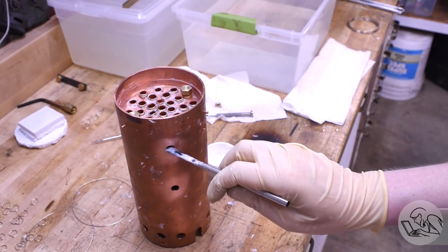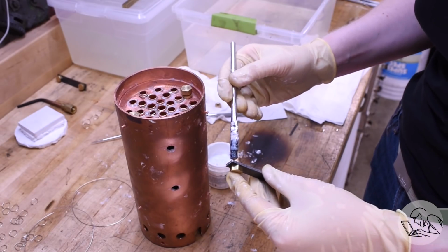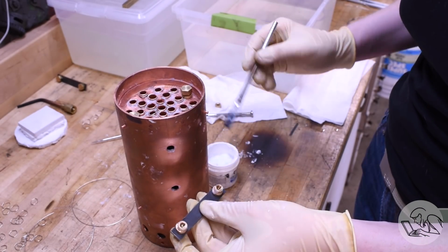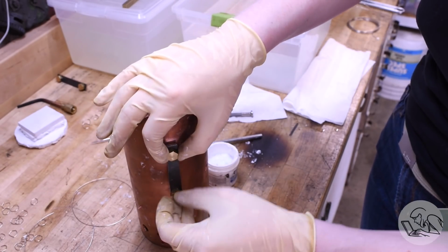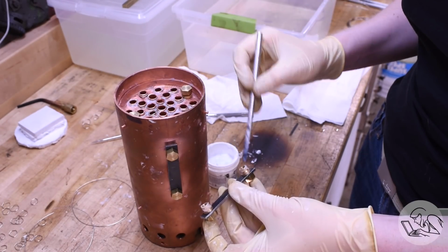And then the same process for the boiler bushings. And remember, I made a fixture plate to hold these at the right spacing and to keep them square to each other. Now this is again the Alex Weiss method, which is different than the Kozo method. Kozo would have soldered these bushings in place by themselves first and then did the next series of joints, whereas Alex has you do all of this stuff all at once in one giant heating.